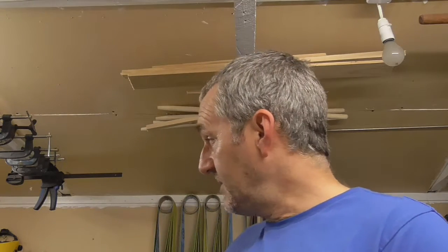I'm also running some more hardness tests. What I did was what I'm calling my bushman's knife. I've been using that, really pleased. Takes an absolutely brilliant edge and really holding it well. And I thought that was potentially, and it maybe is, down to running a normalising cycle before I did the hardening and tempering. It wasn't until after I'd tried to put the video on, which didn't work, that I remembered I'd done the normalising, but at the same time I'd altered the hardening temperature.